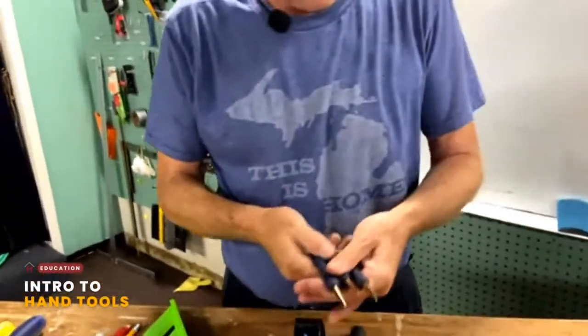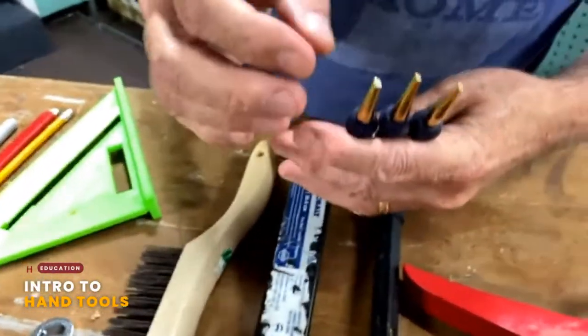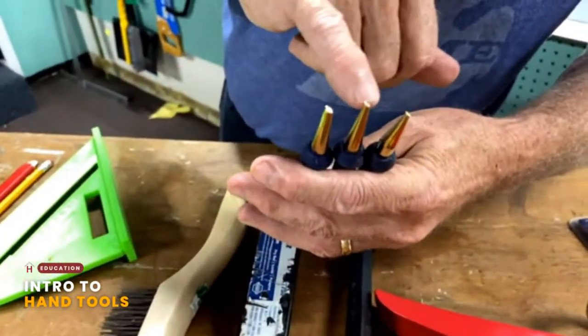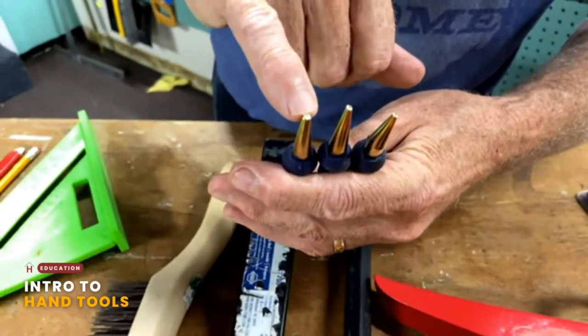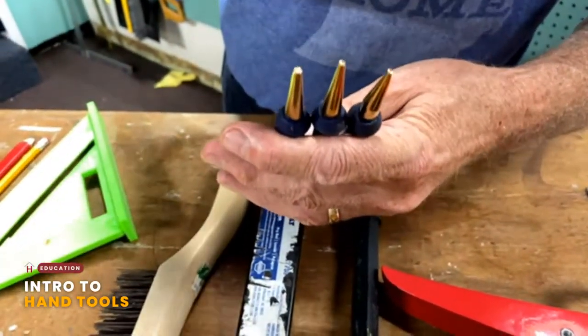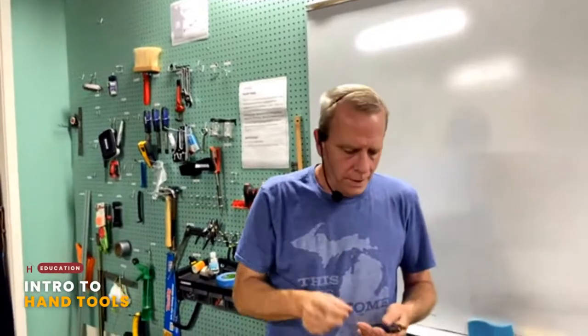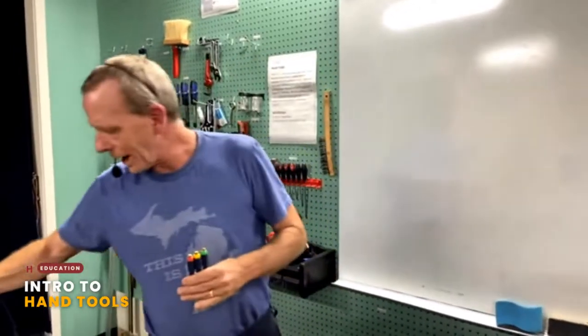So nail sets. They come in all different types out there. You can tell by this one, this is for a larger nail head, and this is for sinking in nail heads. So like just trim nails or something along that line, to be able to sink these in, to be able to put a filler in, to basically hide things, to be able to set those nails so you don't have a big old hammerhead leaving marks on whatever it is,